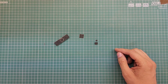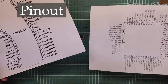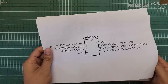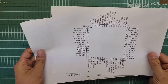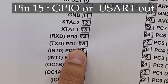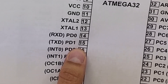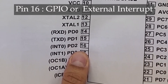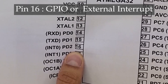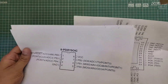Inside the data sheets, you can find the names of pins labeled as pinout. The pinout section indicates the name of each pin, and based on their names you can guess their function. Usually, each pin can have multiple different functions. For example, pin 15 on this ATmega32 SMD package can be used either as a general purpose I/O or as a UART protocol output. Similarly, pin 16 on the ATmega32 DIP package can be a digital input/output or an external interrupt input.